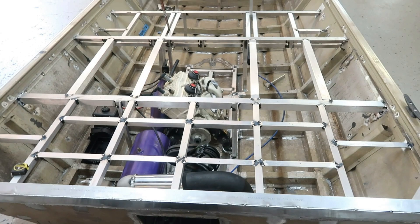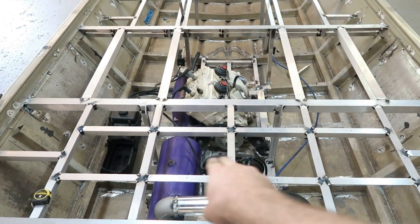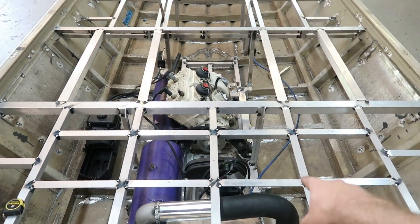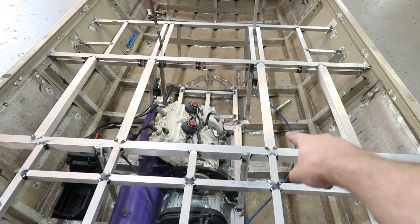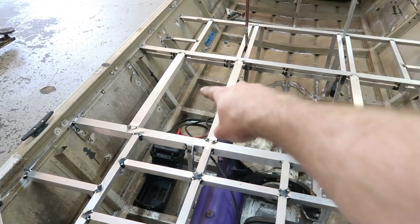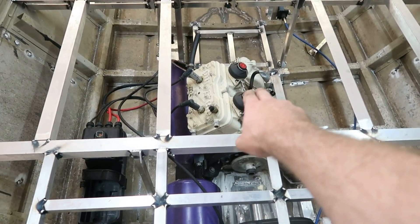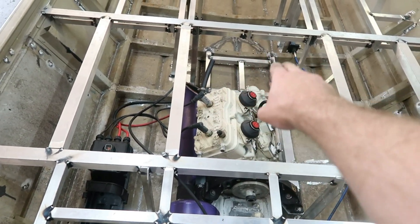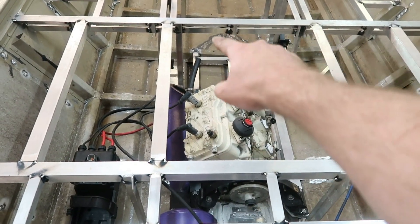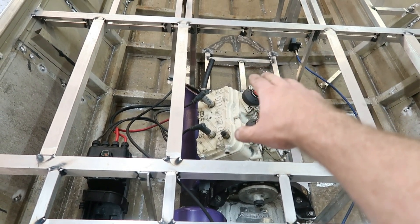Looking at the framing — pretty simple setup. It's going to have a long hatch door here so you can reach back in, the bilge pump will be down there, then a cabinet door right here and again over here will be a cabinet door. This portion — I don't have the header pipe on here yet, but it actually sticks up above the deck height, so this area is going to have a fiberglass bump in it to clear that header pipe.